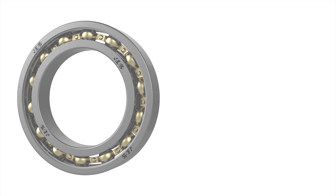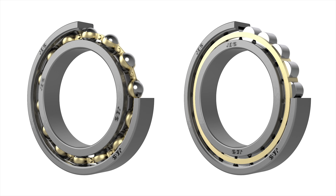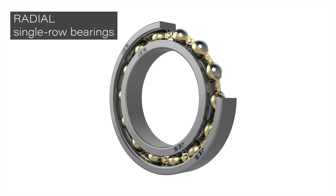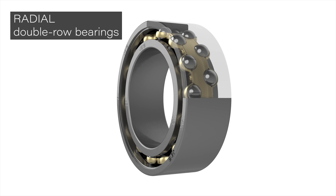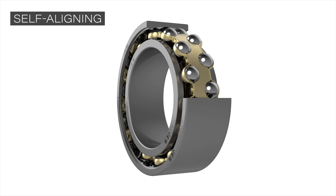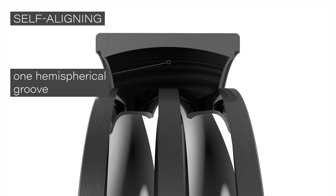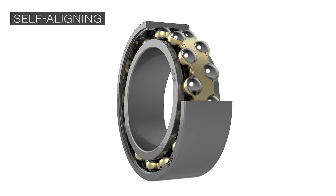The rotary components of rolling element bearings make movement easier — they are balls, as shown before, but also rollers placed between the fixed part and the moving part. Ball bearings are among the most used bearings. The radial ones can be classified as single row bearings, the most common type, or double row bearings, which can withstand high radial loads. Among the radial ball bearings we also find the self-aligning bearings, which have two rings of balls. This type has an inner ring with two grooves placed side by side, while the outer ring has only one hemispherical groove, allowing inclination of the two rings' axes during functioning.